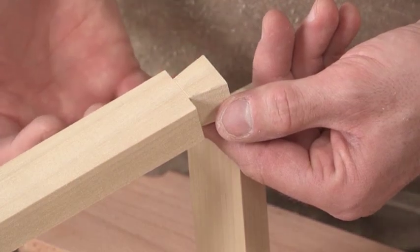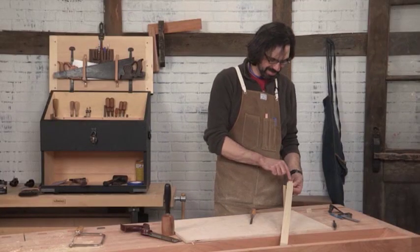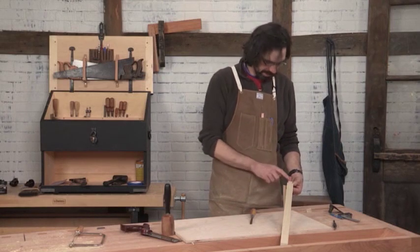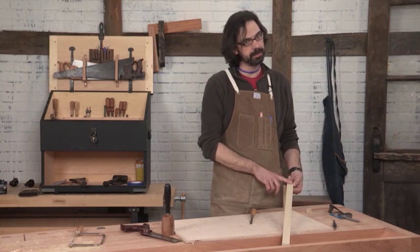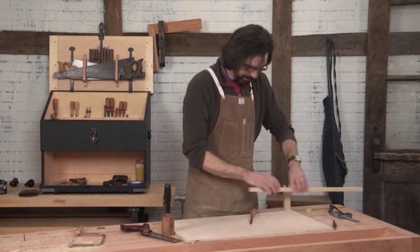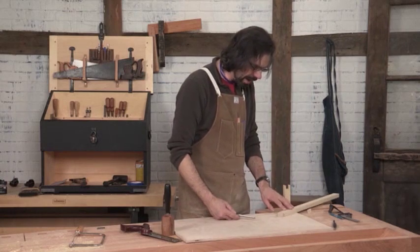The second thing it will do is it will prevent you from making a mistake by putting this into the other pin board before it's time. Because if you pick this up and say, oh, I'm going to test it in my other pin board, and you see, oh, those corners are relieved, then you've already completed that joint. So it's a little aid for not making mistakes.